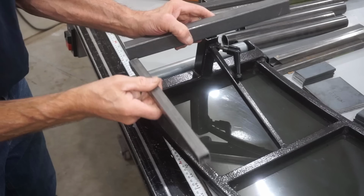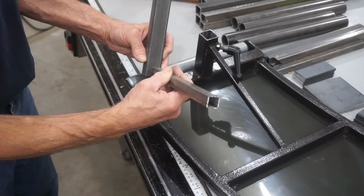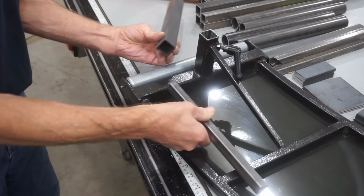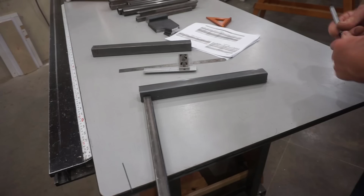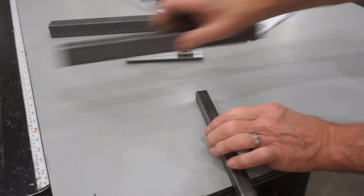So the notch is 3/4 by 3/4 so that this piece of square tube passes through that piece of square tube. And because it's not a through cut, I approach it a little bit differently, although this isn't brain science either. There's any number of ways of marking these cross tubes that got cut in episode one for the notches for the roller ramp tubes. But rather than using rules and squares, I'm just using a clean cut on a piece of 3/4 by 3/4 square tubing and a fine Sharpie marker to mark the notches on both ends of both tubes quickly and accurately.